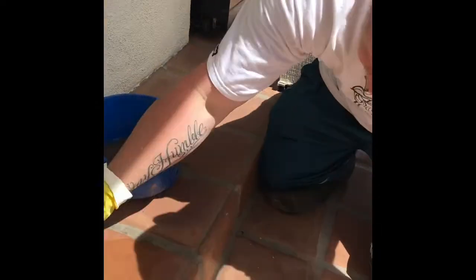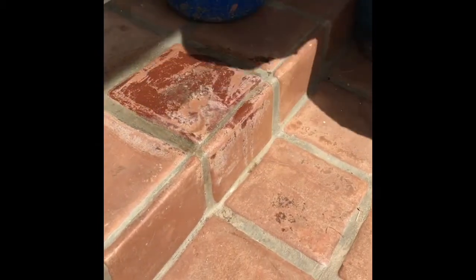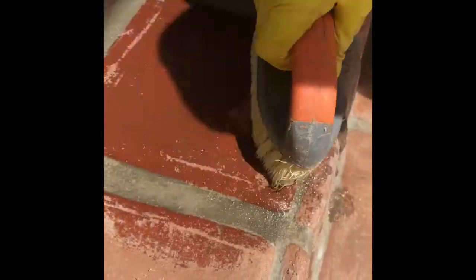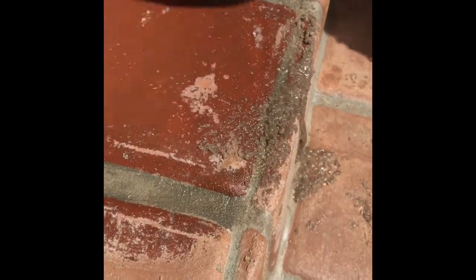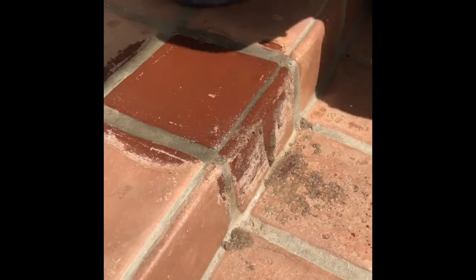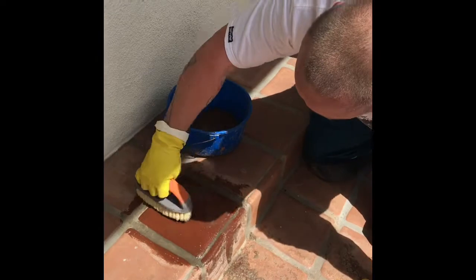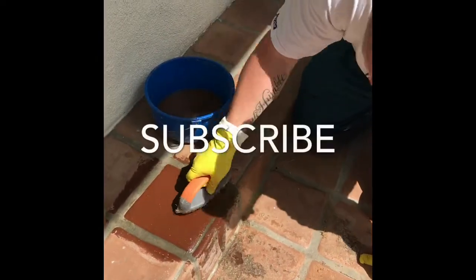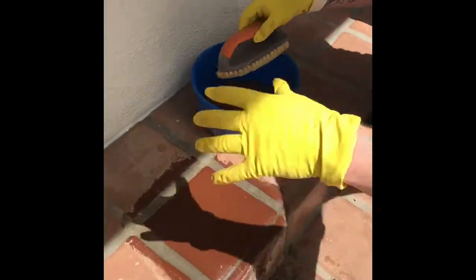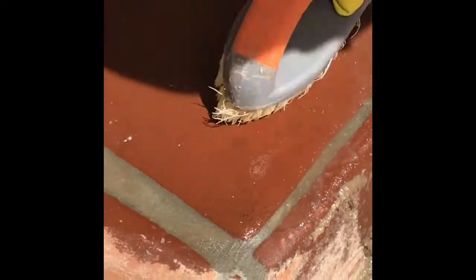We'll start off. We always start above it because it's going to run down. You let it get wet for you, and you can see immediately how it gets dark here. That's because my stripper's melting it. Ladies, you know, you've had fingernail polish removed before — it's real similar to that. Gentlemen, if you've stripped furniture or used some goof-off or acetone, it's all chemicals, but this is more designed to melt and remove things. What it does is it melts it from the inside out. That's why it got dark.